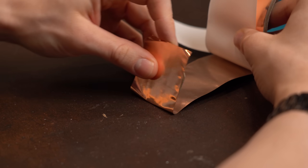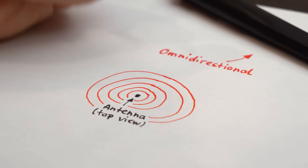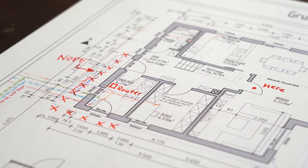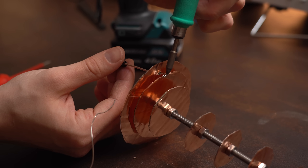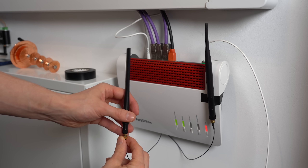While building the WiFi Beam antenna from cardboard, copper tape, nuts, and bolts, it's worth noting that all antennas tested so far were omnidirectional — radiating electromagnetic waves equally in all horizontal directions. Looking at the house layout, coverage is most needed in specific directions, which is exactly what a directional antenna provides. After hooking it up and running measurements, however, this directional antenna performed noticeably worse than the omnidirectional ones — so despite looking cool, the classical antennas win.